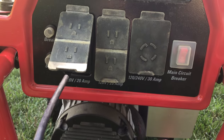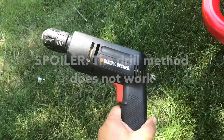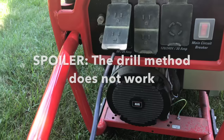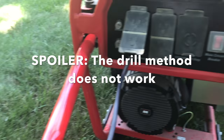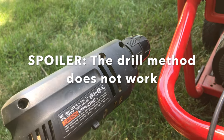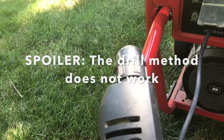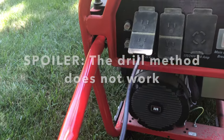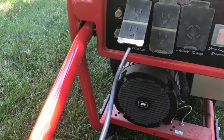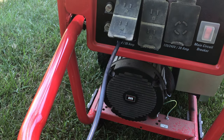The engine works fine, and yes, I did check the breakers and all that kind of stuff. So the strategy is to take a corded drill, plug it in here, hold down the trigger and twist the chuck backwards. You're actually sending electricity into the generator. By sending electricity into the generator, you can excite it again in order to make it start running.